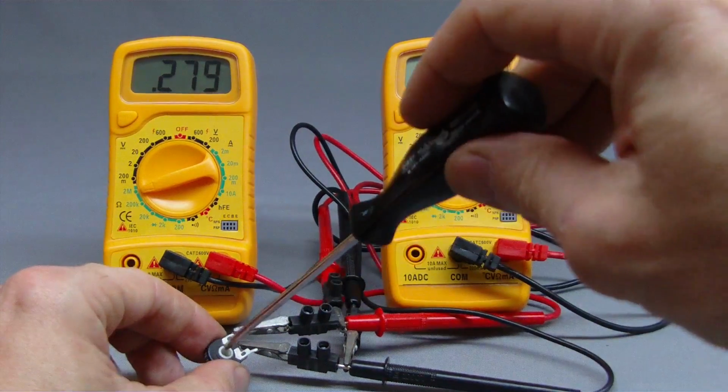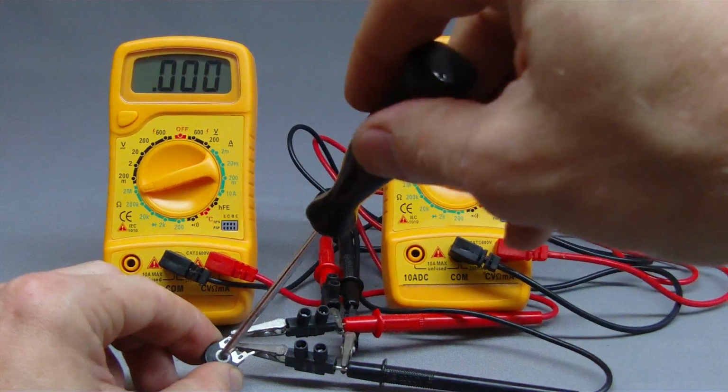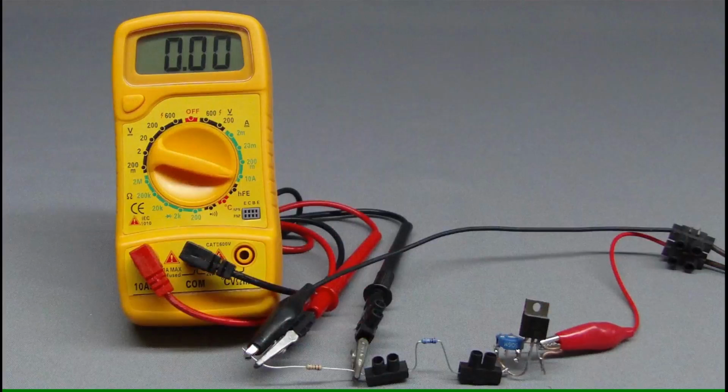The displayed resistance value of the potentiometer is curious. While the second multimeter is connected in parallel to the first one, the value is just 457 kΩ, in comparison to 846 kΩ without this instrument used for voltage measurement. Effectively, there is another resistor connected in parallel to the potentiometer by attaching the second multimeter. More about this will follow later in this video. Let's do some indirect resistance measurements.